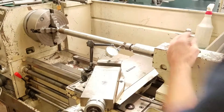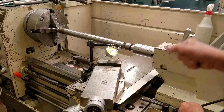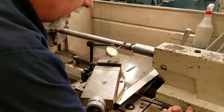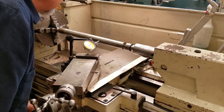We can give a little adjustment here. You can see right here these two screws - they actually move our tailstock. I just moved it about one thousandth. These screws move the top of the tailstock in and out; they have a gib with it. Now I'm going to take the indicator back and see how well it looks.